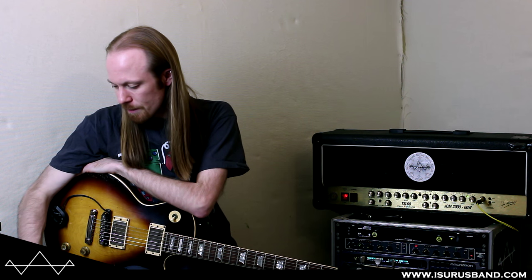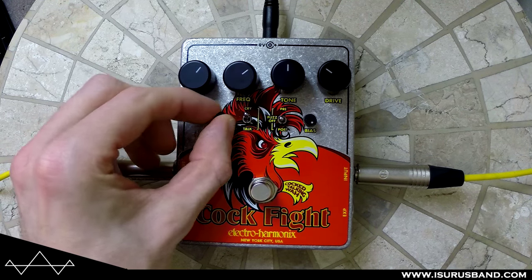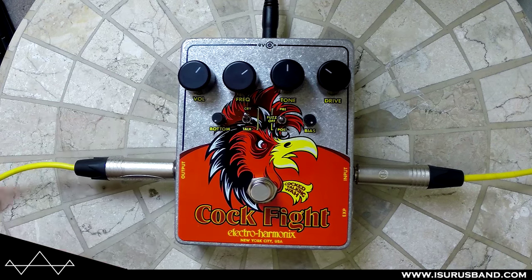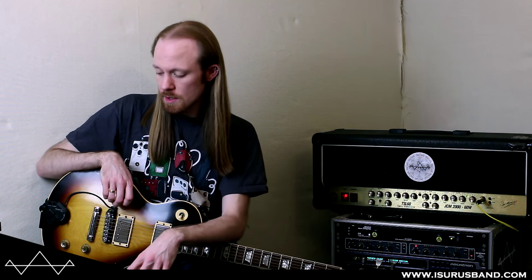And another feature of the wah section of this is this bottom potentiometer here. So when you have it fully off, it's functioning like a standard wah pedal. So it's affecting all of your signal, and generally what happens in that case is most of the low end just disappears. So what this enables you to do is leave that bottom end in there, so it's obviously got some sort of crossover circuitry, and it runs that alongside the wah circuitry, so the wah stuff you're doing is only affecting the upper register, the treble frequencies, and all the bottom frequencies are left in there.